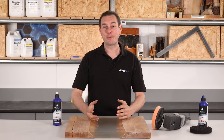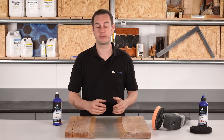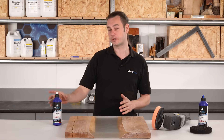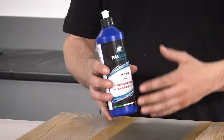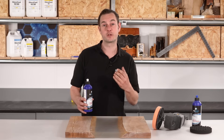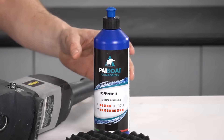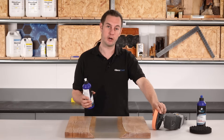To recap: we've taken our epoxy surface from a machine finish right the way up to 1200 with the sander and abrasives. If you've got the right polishing compound, 1200 is as far as you need to go with the sander. We're going to be using two polishing compounds: the NW1 and Top Finish Two. The NW1 is specifically designed for hard plastics like epoxy and is quite capable of going from a 1200 grit to a good level of gloss. We're going to begin with the NW1 and for this coarser compound, we're going to use the medium hard pad.